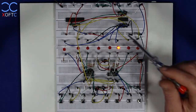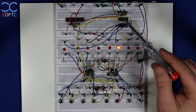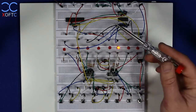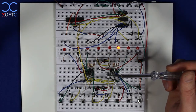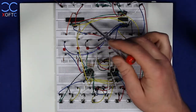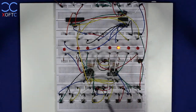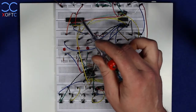Now, when I first started making this circuit, I pretty much just used regular functions, so a binary counter and a timer and a line encoder, and I got pretty much the same result. But then I was thinking, and I showed those examples a lot on my channel, so I thought this time I will use an AVR, a microcontroller. And the reason why I decided to use a microcontroller is to show you that this entire game, this entire circuit, only uses 4 pins on the microcontroller.